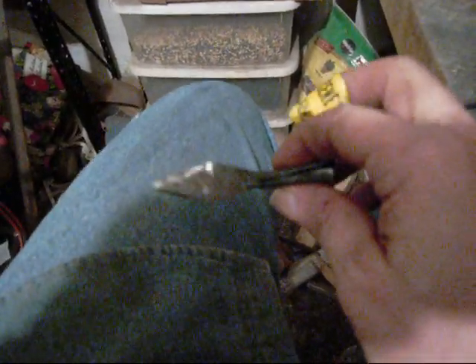Keep in mind you could use these — make them bigger for an atlatl, make them even bigger for a spear point. Really just whatever you'd want to use them for. You could make field points out of them, bodkin tips. You could actually take and widen one out some and cut back in with barbs coming back in for more of a fishing tip, so it'll poke in and have two points coming back out to catch the fish on — just take a file and cut that out. You'd have a nice little hunting point there.